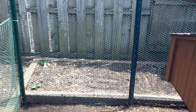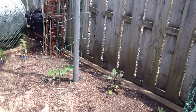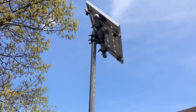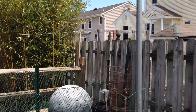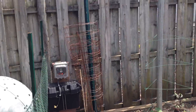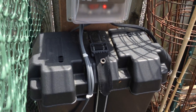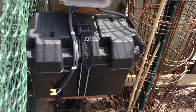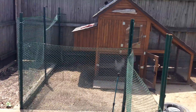One of the unique features is I decided to run it off of solar. So I have this pole with a 60-watt panel up top, wired to a solar controller that I purchased, and a Group 27 series AGM absorbed glass mat battery. That's wired to the chicken coop.